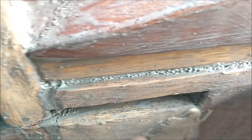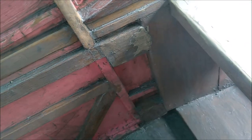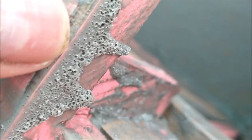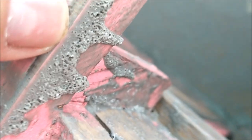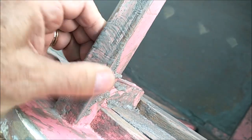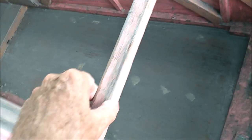If you don't, you get that foamy crap — all rough — and you've got to try to sand it because it's just like sandpaper texture. It foams up and makes a mess. See right here where it dripped and got thick — when it drips and gets thick it gets that foamy hot-lava texture. You've got to sand through all that thickness all the way down to get a smooth surface.